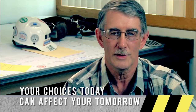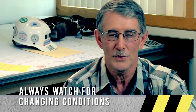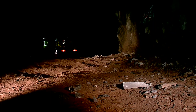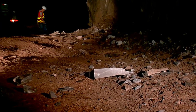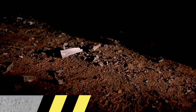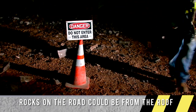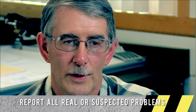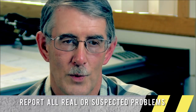In some cases it's just an edge of a rock — the air dries it out and it's not really loose. But you really need to investigate all of them to make sure. If a miner finds rocks laying on a haul road, they would cone off the area and change the traffic direction while it's being taken care of. A new miner, when he thinks he sees something or has a question, should always go to management or an experienced person to clarify the situation.